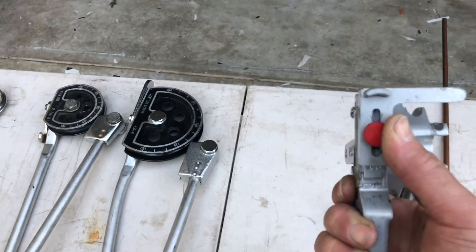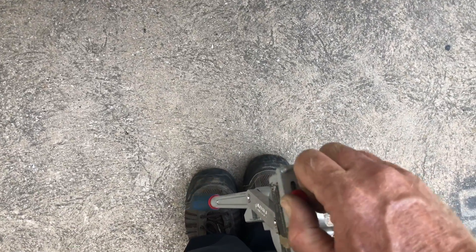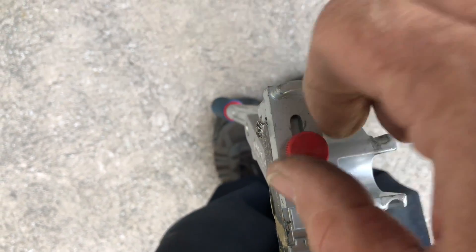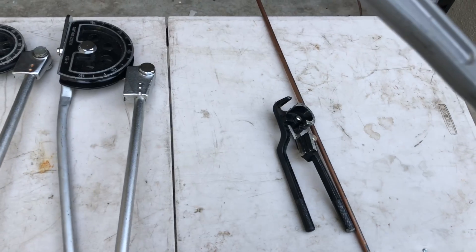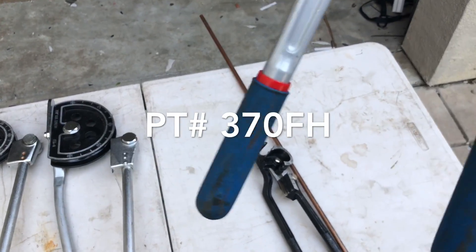You can move this piece right here in the middle. I'm going to hold right here and show you. As you step up, you can move this for the bigger pieces of pipe. You can see there — these are the three pipe sizes: quarter-inch, three-eighths, and a half. You would set it accordingly. I'm going to be playing with some three-eighths today, so I'll put it right here. This one's adjustable and makes tighter radiuses. This is the Imperial.